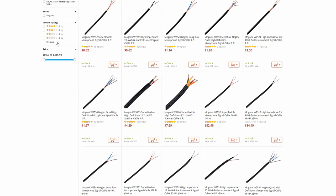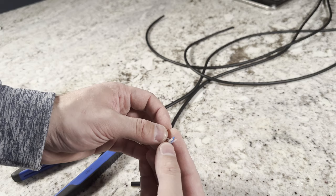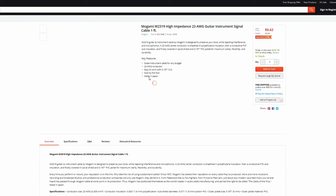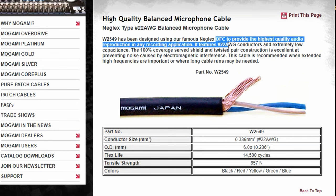Instead, we're going to be using Mogami. Look how much more flexible it is - we can twist it, turn it, and cable management is not going to be an issue. The cool thing is we buy it by the foot and it's really inexpensive. You can buy it right from Parts Express - I'll leave links in the description below. This is their two-core connector, which has an outer shield and two inner cables. For most RCA cables you'll use their single-core connector. Mogami is made in Japan, uses oxygen-free copper for signal quality, and has a shield - making your own RCA cables very easy.